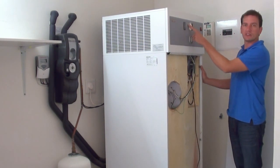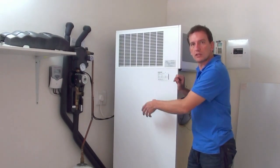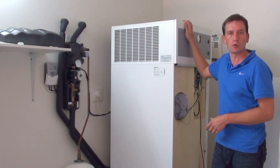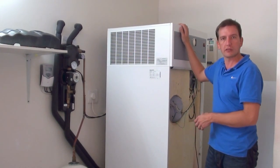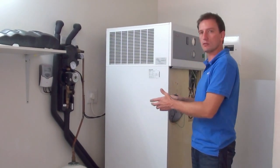There is also a normal temperature setting to adjust the heat pump operating temperature. What I've shown today is a combination solar and heat pump integral system — the smallest system we offer, suitable for families of four or less. For hotels, commercial systems, or larger applications, we split the heat pump and provide individual tanks with heat exchangers to marry the two systems.